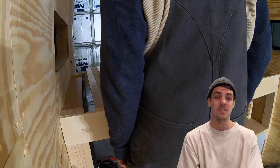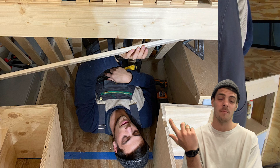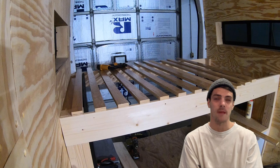This part was slightly exhausting. I started by going through with a nail gun first just to make sure the slats were in place, then followed up with screws after I knew where they were supposed to be. It looks like it's going smoothly here, but this was after a lot of trial and error about five minutes before this was filmed.